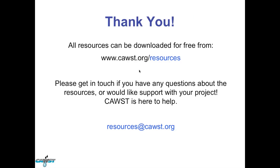I have a question here from Forrest Candall about the version 10 no ledge molds. How are you building diffusers for these filters? Basically, what we recommend is a sheet metal diffuser. It's constructed out of sheet metal, which you can often find somebody locally who is a sheet metal worker, and you bend it up into a box. The bottom of the box has holes in it, and then it has a lip on the top, and it hangs from the top of the filter. So instead of sitting on that ledge, it has walls and it hangs from the top of the filter. If you download our construction manual, there are instructions in there on how to build the diffusers, both plates and boxes.